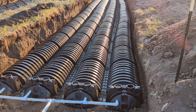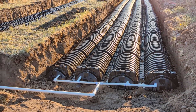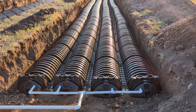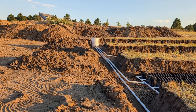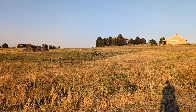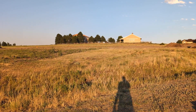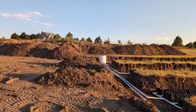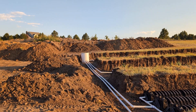After the pump runs, this is a downhill run to each bed from the distribution valve, which has a built-in vacuum breaker allowing all the effluent to drain out with gravity to the manifold and out those bottom weep holes after each dose. The bottom is about two feet deep at the shallow point with a foot of dirt on top, so there's potential freezing concern during long cold stretches — that's why the pipes drain out every single time it doses. There's also a weep hole near the pump to back-drain in the other direction, so all pipes clear out and won't freeze.